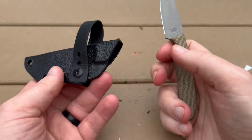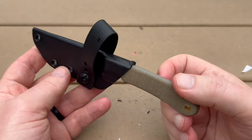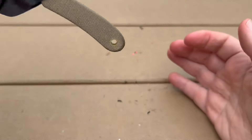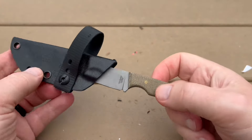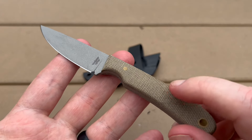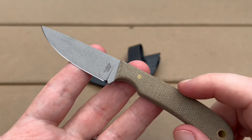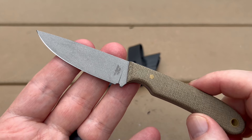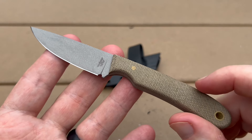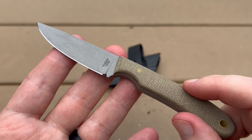Usually the sheath is leather. If you're looking for a Kydex sheath like mine, check the website carefully and reach out to him if you're not sure. This Kydex sheath has really nice retention. Total weight is going to be less than 1.8 ounces — how much less depends on what type of scales you choose. Overall length is 6.5 inches; the blade is three inches long, which means it's going to be legal in most states — but check your jurisdiction. Hardness rating is about 60 to 61 HRC.